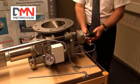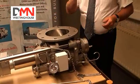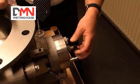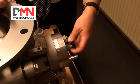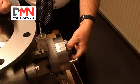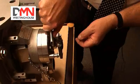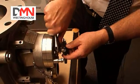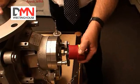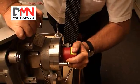Now we can remove the central T-bolt and replace the locking nut. We screw the locking nut up until it just touches the rotor — it has been made very small for that purpose — and then we lock it in place. Don't forget to put the cover back on; it is a moving part so we have to cover it, as required by European legislation.